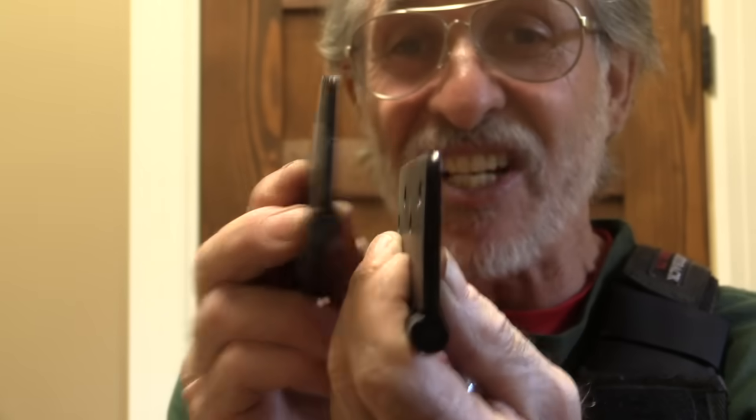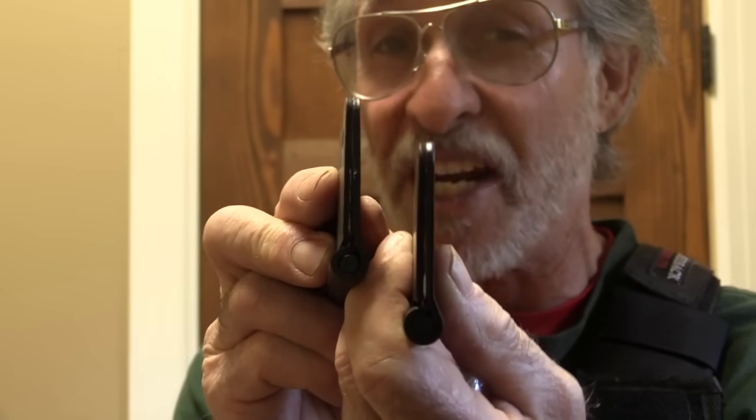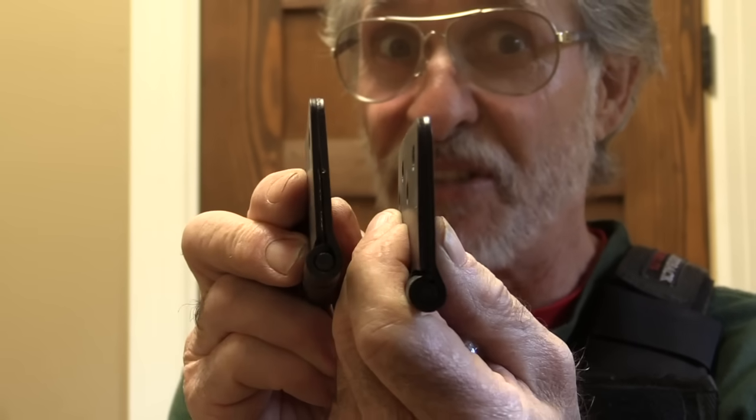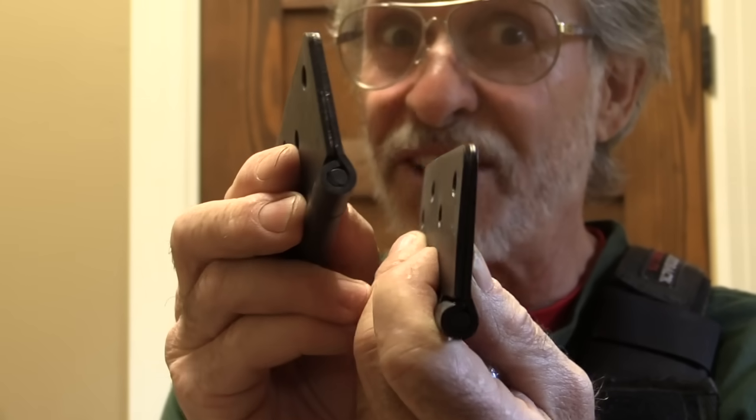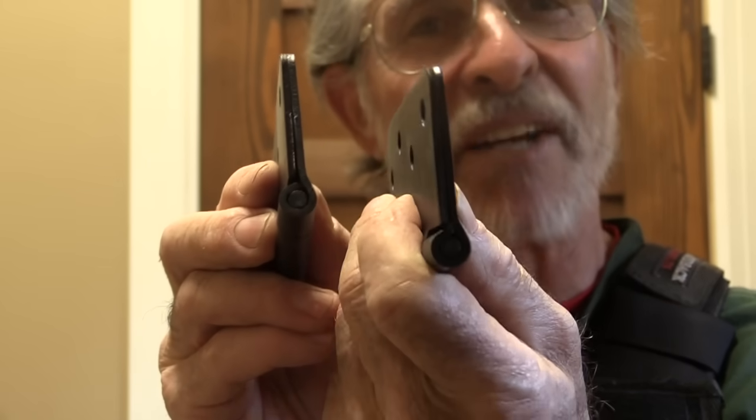So this hinge is going to space the door a little bit more off the jamb than this hinge. So if this were the top hinge, you'd have a bigger gap between the door and the jamb than you would at the bottom hinge. I hope you understand what I'm talking about.